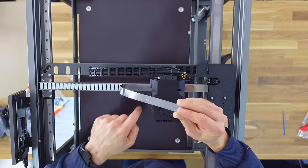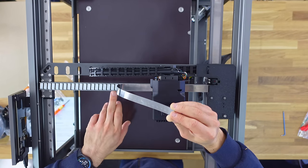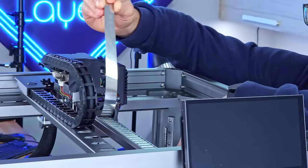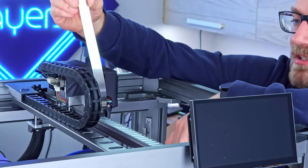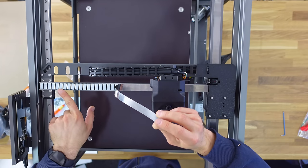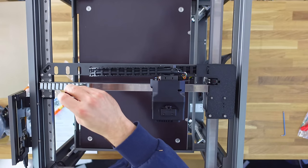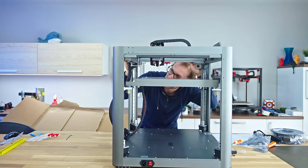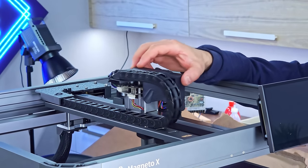So essentially you have a magnetic coil, or three magnetic coils, in the tool head that push off of that field that the magnets generate versus the coils generate. And this is essentially just a dust shield to make sure that you don't get metal shavings and stuff in there. That looks quite coarse. If this was a stepper motor, then this would have a step size of 10 millimeters or something. But because this is a closed loop system and this entire setup knows where it's at positionally, I don't know where it's measuring that, but it doesn't matter how coarse the actual motor is.